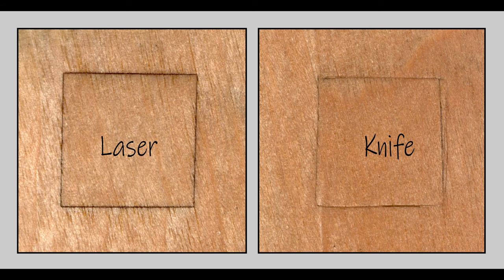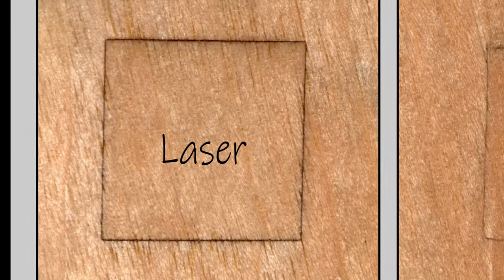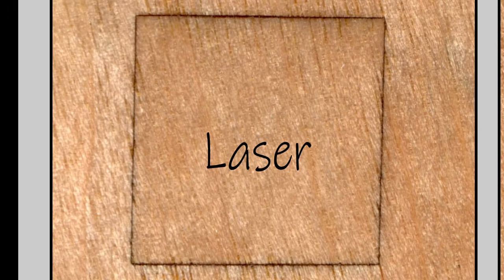Lasers cut the wood by burning through it, so some discoloration is inevitable on some lighter wood species like birch and maple. The example shown here shows a worst case scenario for edge charring because the veneer is relatively light. The image on the left was laser cut, flopped, air assisted on a honeycomb bed, and the one on the right was just cut with a knife.